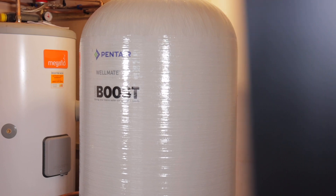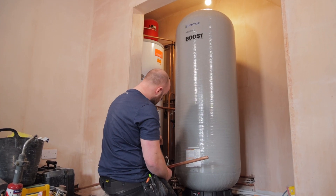The pump will maintain 12 litres per minute. This will be supplemented by the additional flow from the tank, which will speed up filling the vessel and improve the natural flow to the property. I've installed the 450 litre pumped AccuBoost, which will provide 36 litres per minute into the system for nine minutes.